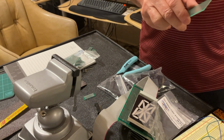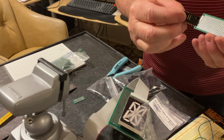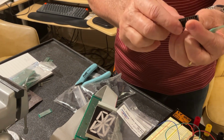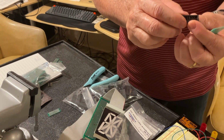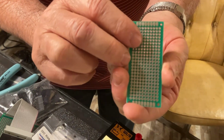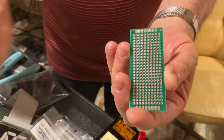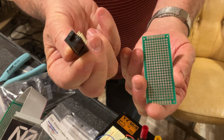You need your soldering station, some solder, a connector. Today we're gonna make a connector, an adapter for 16-pin connectors. So 16-pin connectors. It's the same principle for 20. If you watch this little board, it has 10 holes per row. So this one has 8 per row, because 8 times 2 is 16 pins.